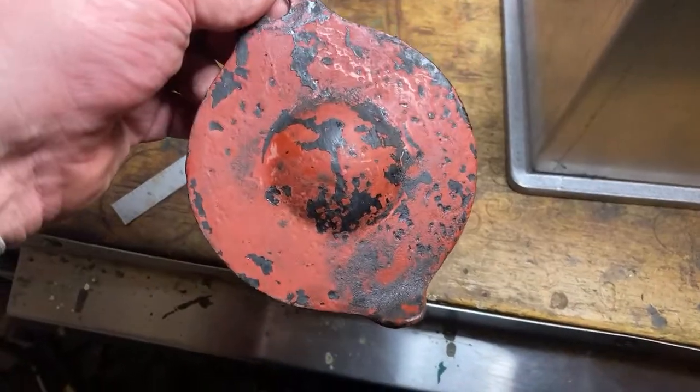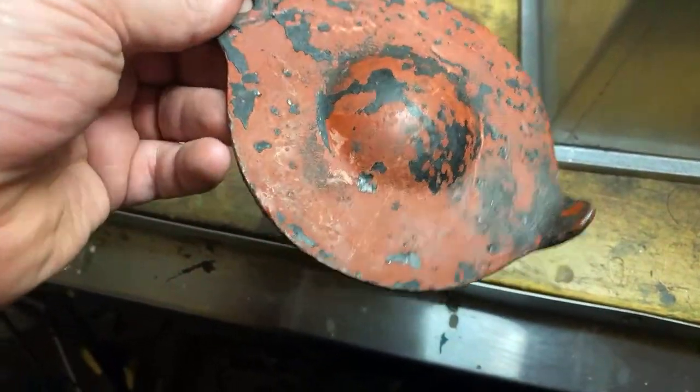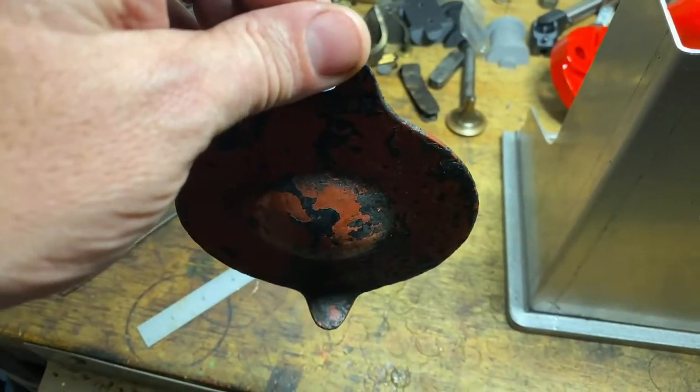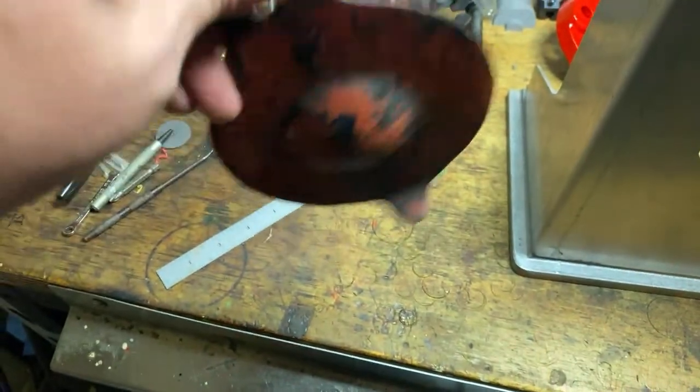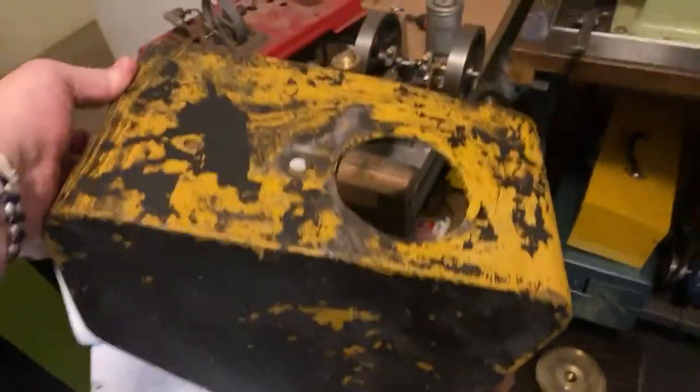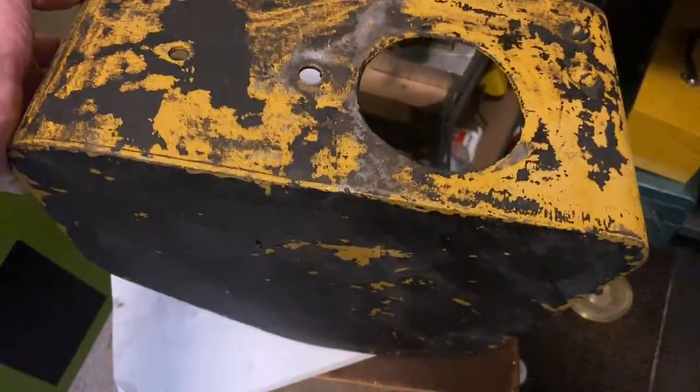That's actually a hinge door. There's two of them on the roller. One of them goes on vertically like this on the gear guard under, behind the wheel. You swing it out of the way to grease stuff or oil stuff or whatever you do. And the other one goes on the steering box, which is, gosh, this monstrosity here, like so, and it's got a hole on the top for greasing and oiling it, and that's where it goes. It's got a rivet on one side, it just swings out of the way over the top of that.